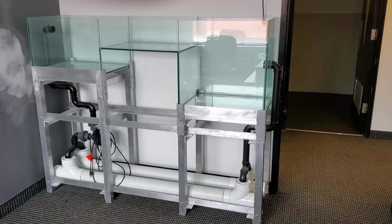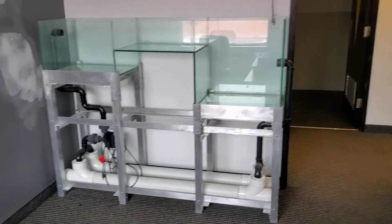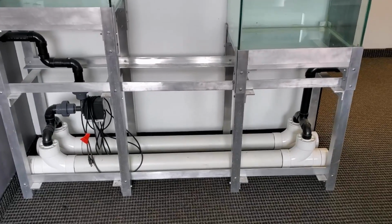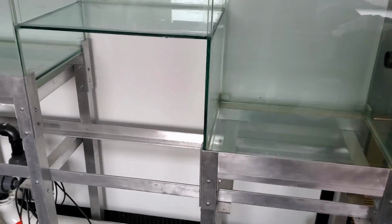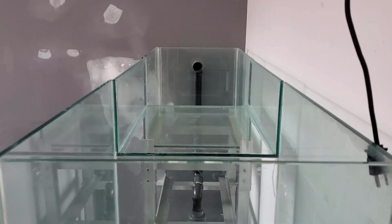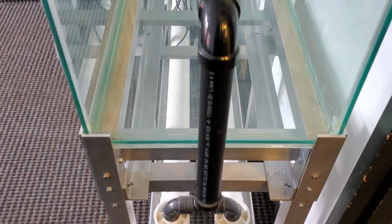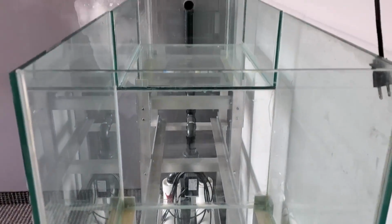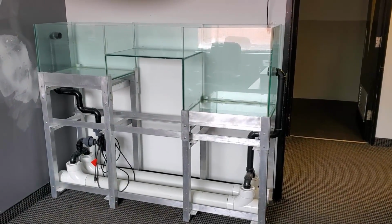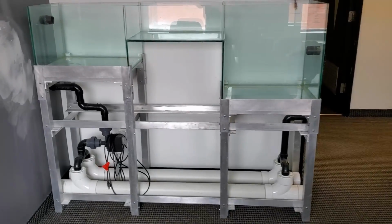The other thing I want to do, normally I would build something like this out of glass. Acrylic has always had issues with larger builds like this because it has more of a tendency than glass to shrink and contract with changes in temperature, and its joints are not as resilient to that sort of thing. But I actually want to give this a try out of acrylic. It's going to have some features I think that will take care of, or at least mitigate a little bit, those sorts of issues. And as it progresses, I'm definitely going to get your input on it because it'd be kind of cool to see what you guys think.